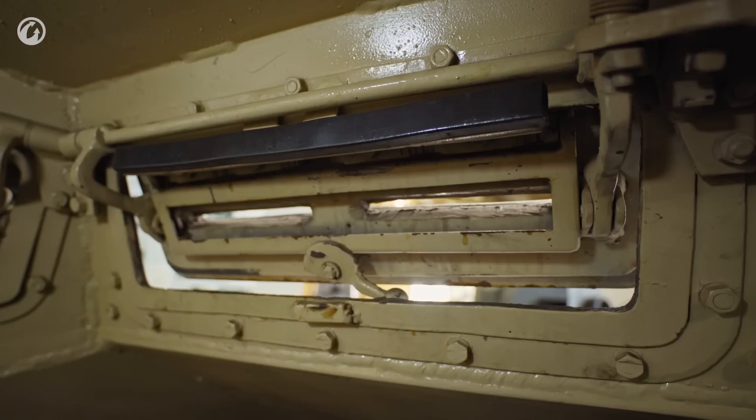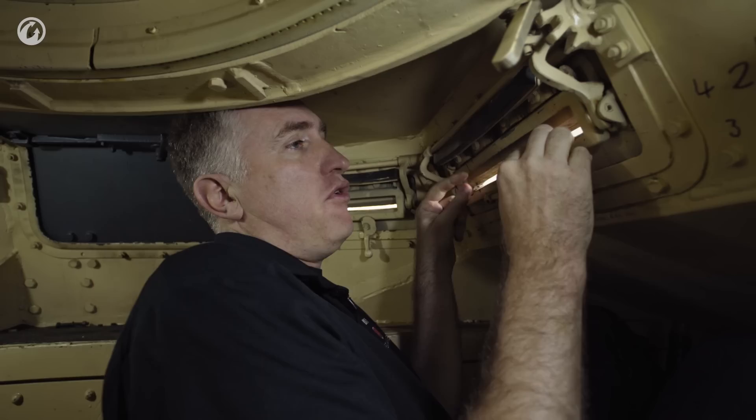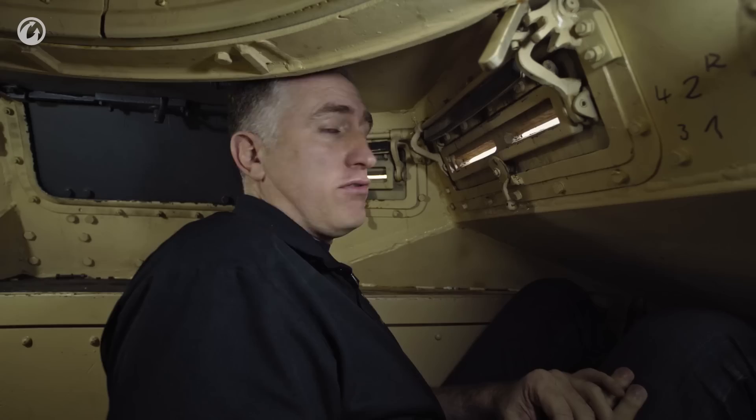They have brow pads here as well, so when I put my head forwards I'm not going to bash it too much. This little lever is quite clever — it not only locks the visor in place, but should bullet fragments come in and hit the glass, triplex, or perspex, rotating it further forward allows the block retainer to swing out of the way. You can then exchange the vision block, put a new clear one back in, close it, and away you go.